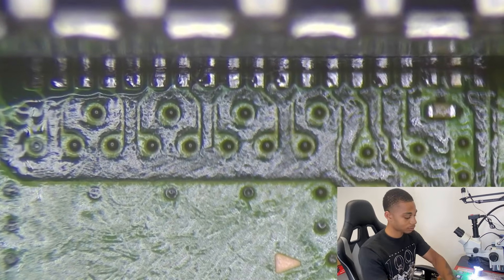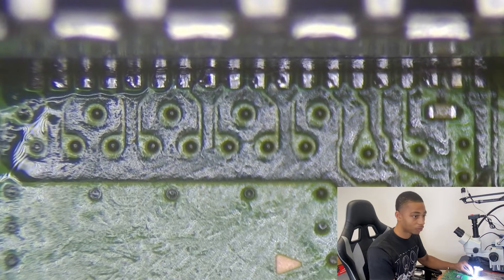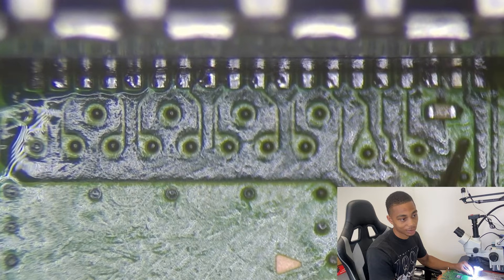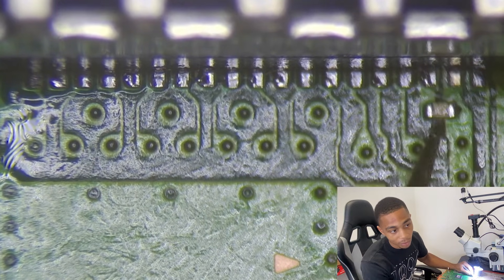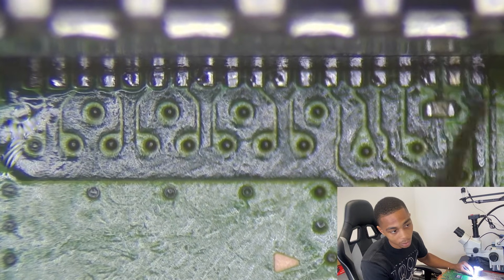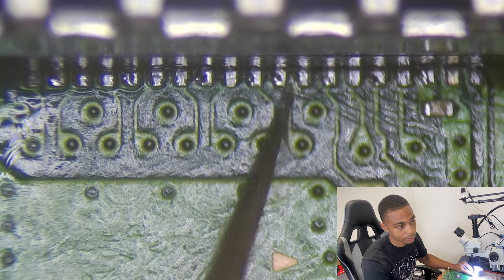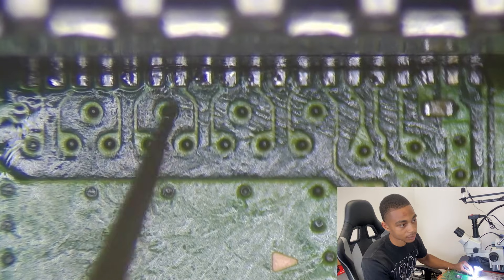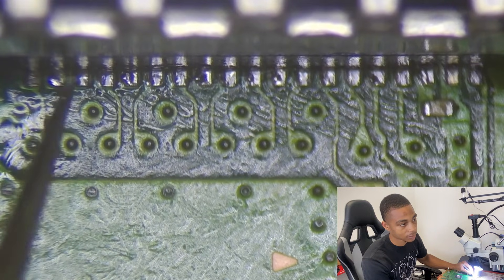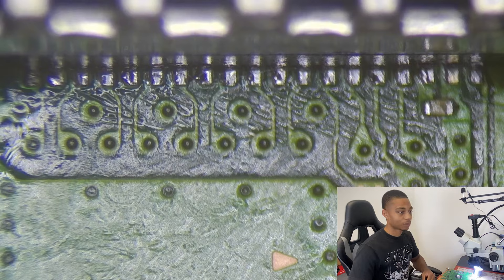As you can see, except for one, all of these pins went ahead and turned silver after I tinned them with that solder. We do have one right here that's still gold because I didn't want to get too close to this capacitor and knock it off. It's a little silver too, though, and it is connected onto that board, so it wouldn't be an issue. Every pin is soldered to that board — to every trace.